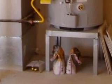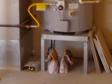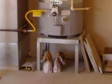In garages — and this applies mainly to units installed prior to 2004 — if the water heater doesn't have a sealed combustion chamber, it needs to be elevated 18 inches over the garage floor to reduce the risk of fire.